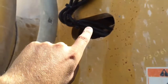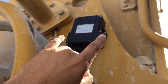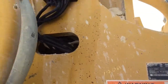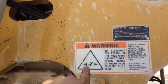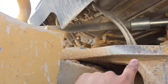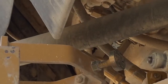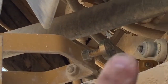Those cables run right through this little area here and come out this hole right below a junction box that took two quarter-twenty holes that I drilled and tapped, one on each side, to hold that box on. There's one main cable that comes out of this — we call it the CAN cable. It wraps and goes through the same place as these pressure sensor cables, then through the articulation and up through the center of the loader underneath the cab. We drill a hole and entered into the bottom of the cab through that hole.